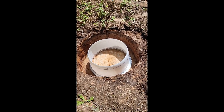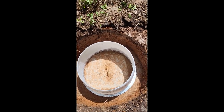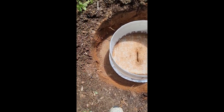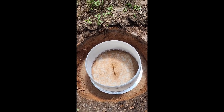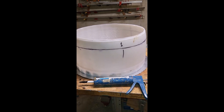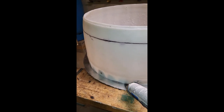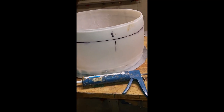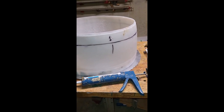As you can see, I made the hole bigger to accommodate the riser. I'm dry-fitting it and everything looks pretty good — it's going to fit right down over and cover all the corners of the lid opening. You can seal that off so nothing can get in there. The next step is to put a bead of caulking around the base so that roots can't infiltrate into the area and get into the septic.